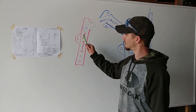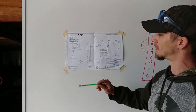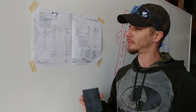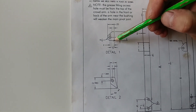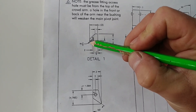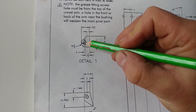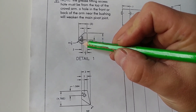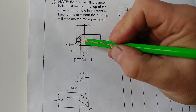We're going to show you how to measure out for these brackets and how you get the little curve on them. Looking at the plans, the piece is three inches wide by four inches long flat stock. This detail right here shows us how to get that curve. You see an R one and a half — that's the radius. To find it, you locate this crosshair. The other crosshair in the middle shows where to drill the hole; we're just focused on this one right here.